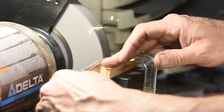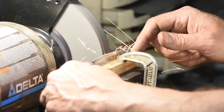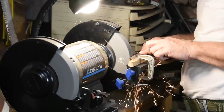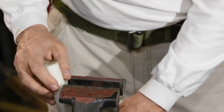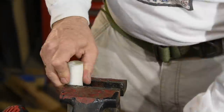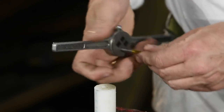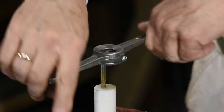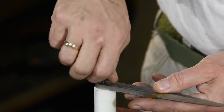The problem with this little grinding aid is that as you grind the bevels, the angle changes slightly and it's harder to maintain a consistent angle at the tip. Once you've gotten the bevels ground 80 or 90 percent of the way, you may want to shift strategies. Here's another approach: I'll take this little Teflon rod, drill a hole, and tap it for a 1/4-20 thread, then use the hole in the tang to screw it onto the rod. See — there was a use for that hole after all.